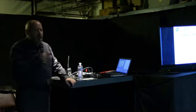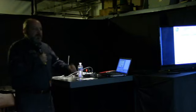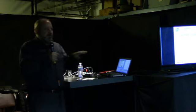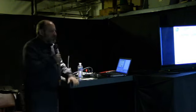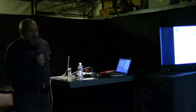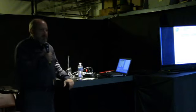So it is digital modulation. This is not packet where you have an analog modem and you're taking the data stream and modulating it and sending it over FM radio. This is GMSK digital modulation. It's modulated that way as digital from the beginning. You can modify an FM radio to do this, but it is not FM. There is some relationship. So a lot of these guys will take analog repeaters, FM repeaters, and modify them for DSTAR use, but they do have to be modified.